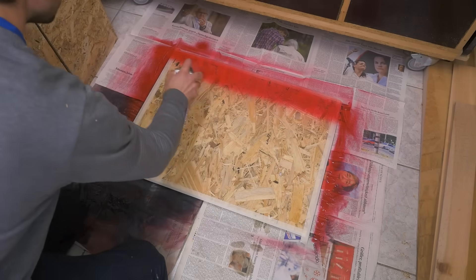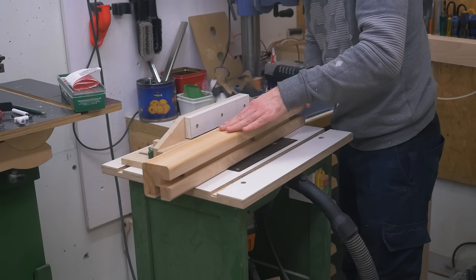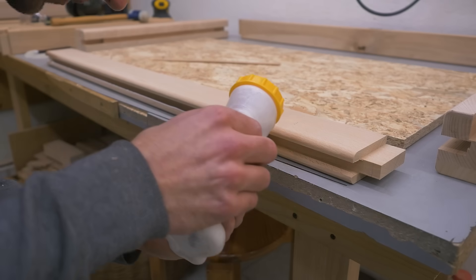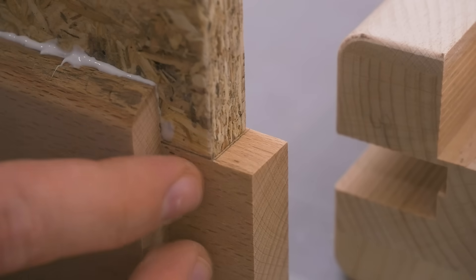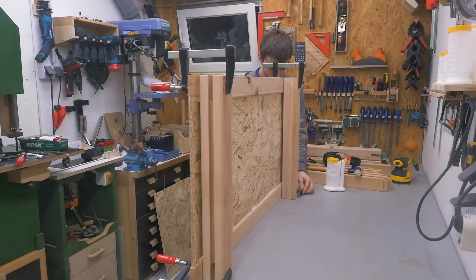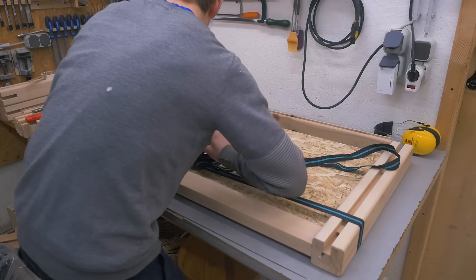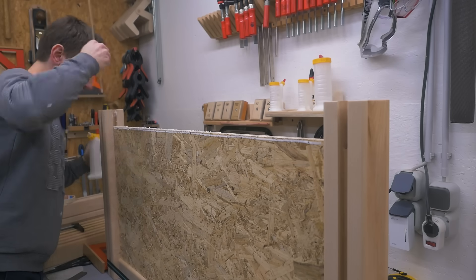I also decided to match their color to the machine. Optional steps before the glue-ups are rounding the edges — 8 millimeters for the inside, 2 millimeters for the outside — and sanding. The glue-up starts with the back panel, which I glue centered into one rail slot. I then put the top rail in place and clamped the legs to that, which should ensure that the panel is straight in the slot. Then I glued the two legs on and clamped everything with a band clamp, checked and adjusted for square, and then glued on the top rail.